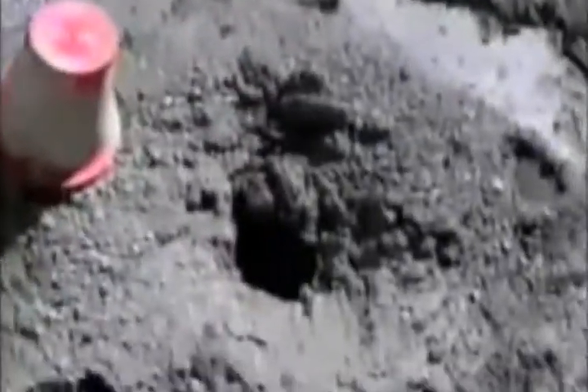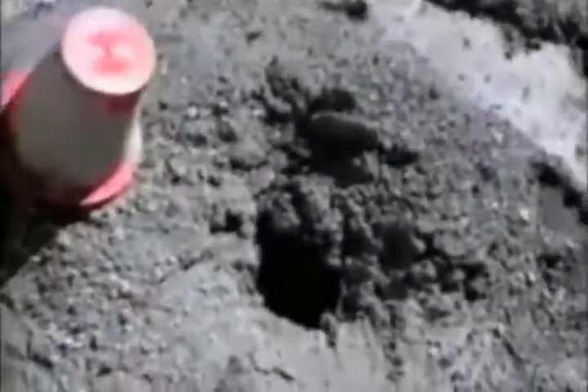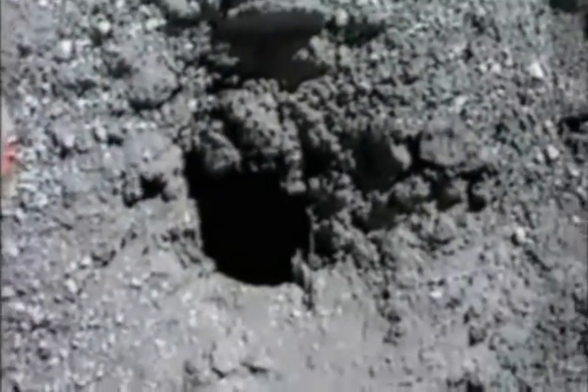Another hole — you can see there is a totally different look to the cuttings in the stemming pile. There's a row of holes here that were collared in quickly and easily, drilled to depth. One of the questions that Wyatt asked me was how it was going to do in water, and these holes are all drilled in a saturated area of the pit with ground water standing in these holes at about 10 feet. You can see the nice, neat collar — the hole is a real precise diameter, six and three quarter down through the sub drill, a place where they've always had problems here before.